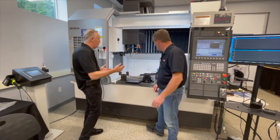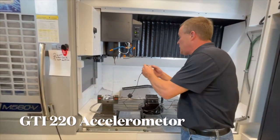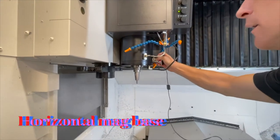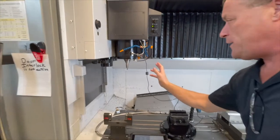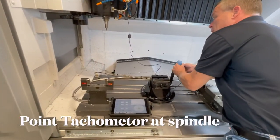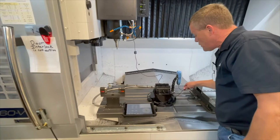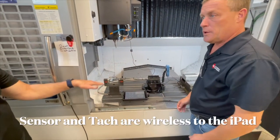Let's show you the setup really quick. We've got our two-channel accelerometer that we had in the last video. We're going to put it here in the horizontal position — this is typically where most of the motion is coming; it's going this way more than that way, the machine's holding it. I've got our tachometer sitting over here set up, and I'm putting the cable down in the second hole here. That's going to read through the cable, through the sensor, and let us know what's going on — wireless right to the iPad.